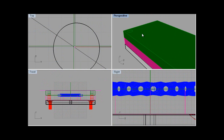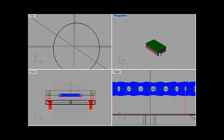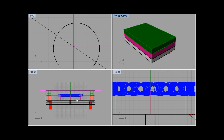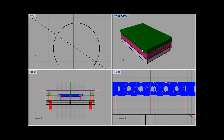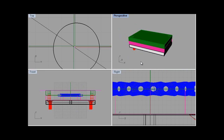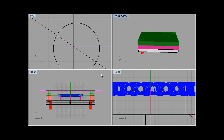Make sure when you do it in your software that you turn it the same way as you do on your software. If it's around, a symmetrical ring, it doesn't matter, but if it's not, it'll cut the wrong side out. So make sure you flip it the same way as you flip it on your software. So if you say, right, I'll flip it around the x-axis, then do that on the software and do it in real life as well.